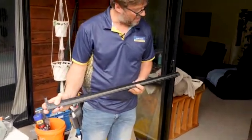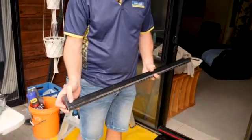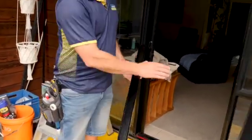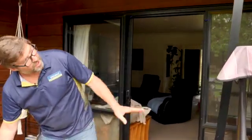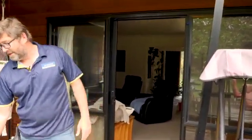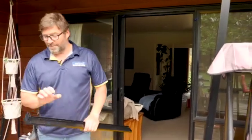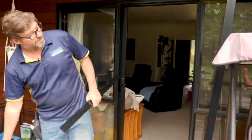you'll see it's the same size. So we do that along the bottom, take off 27 mils, but for the jamb side, because it's got 2 corner jointers, we're going to need to double that. So we take off 55 millimeters, 27 and 27's 54. I add another couple of mils, so we'll make it 55.